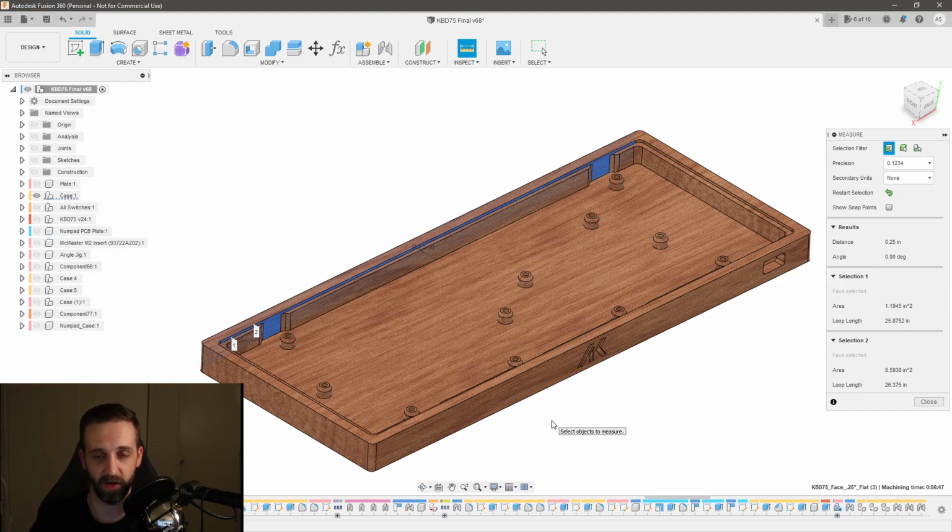And I had just cut off my dowel pins and was like, how in the world am I going to get this back on my CNC and trim this back up? Or do I have to start all the way over? Because this is a nice piece of wood and I just spent all this time machining it. And I was like, oh my God. So this is when I kind of learned my lesson about making sure I'm diligent in my setups, making sure that I'm not being too aggressive with my cuts and I'm not losing steps or anything like that.